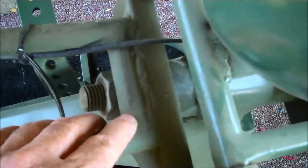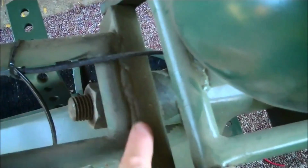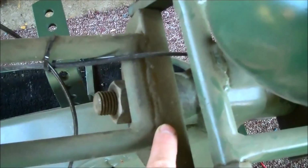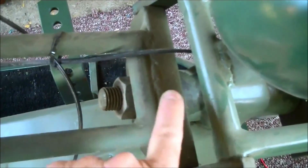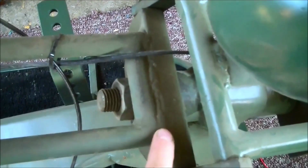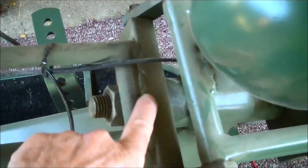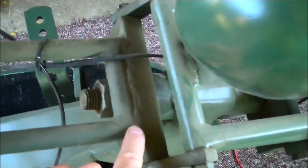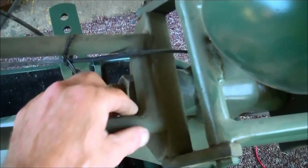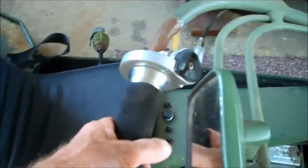One thing I got to say is that this weld here, you can see where I've got this extra piece right here, and this weld here is probably one of the most critical welds on the whole scooter, because your life is in your hands, literally right there. Don't want your handlebars breaking off. So I put a super duper weld there, just weld the daylights out of it, and it's welded all the way around, and this extra piece here is just to add extra meat to that weld. Need to be able to lift the whole entire scooter by the handlebars.